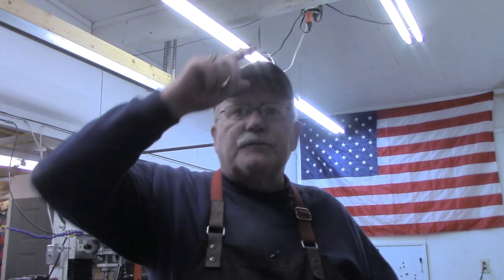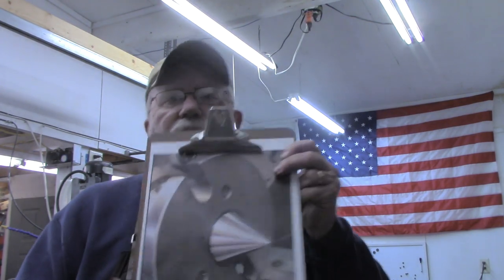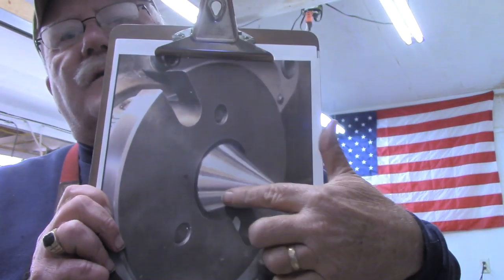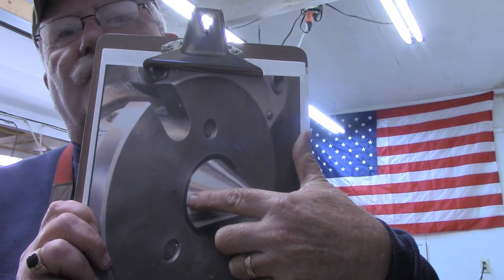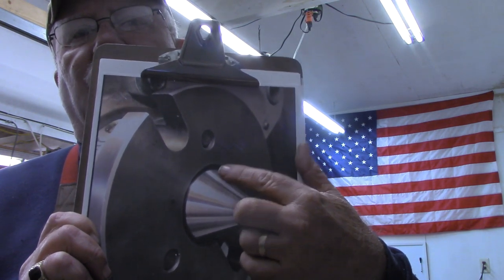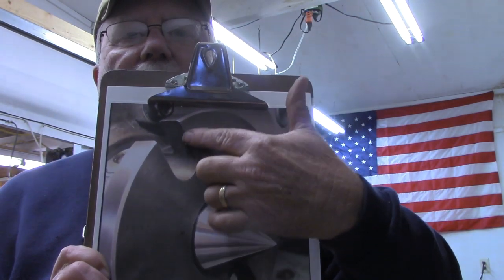I was watching some videos, as we all do. Another creator, Chuck Barmerino — Outside Screwball — recently did a video series on making or turning a dead center for his lathe. He had picked up one where the taper didn't match. I don't remember the name of the taper in his headstock, but it was not a Morse taper. So he was turning that, and in that video he showed a picture of his drive plate. That's what we're going to try to make in this video today. He was very particular to get the face of the drive plate even with the end of the dead center, or the crown on the dead center. That's what we want to do here, so that the dog can reach into this slot.